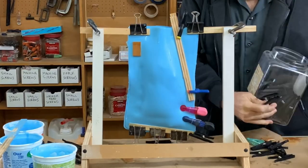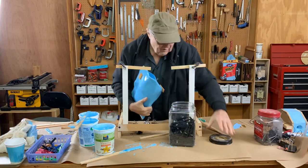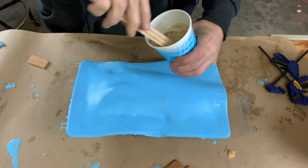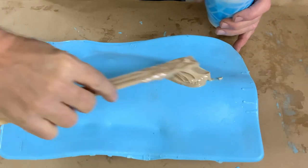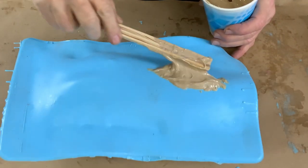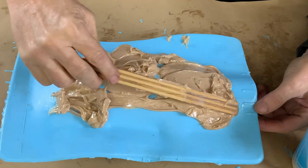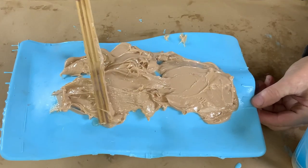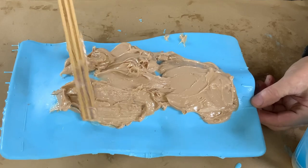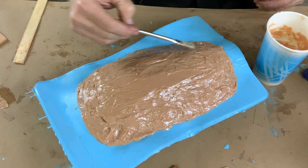It's the next day and everything's looking pretty good. Let's get this thing taken apart. The mother mold is a hard shell that supports the rubber blanket and is also great for distributing the closing forces of the rubber bands. I'm using a resin called Trowlon 60 from Silpak. When you mix it, it turns thick and then it's just like frosting a cake. And when it cures, it turns into a really tough, hard shell.